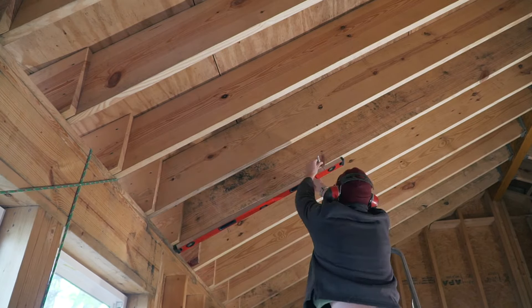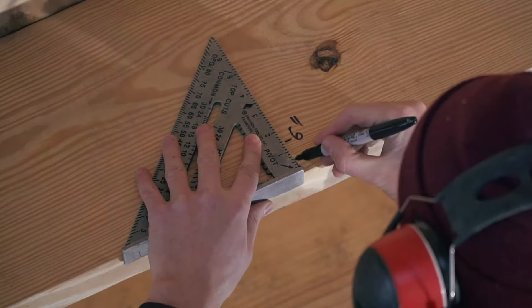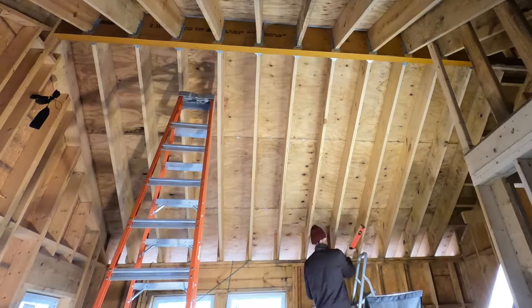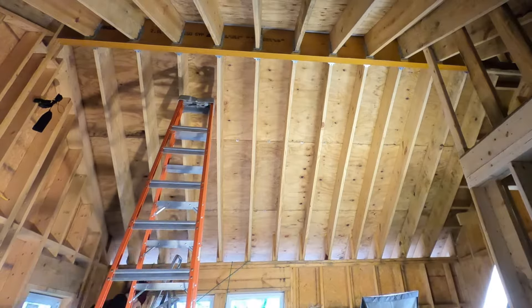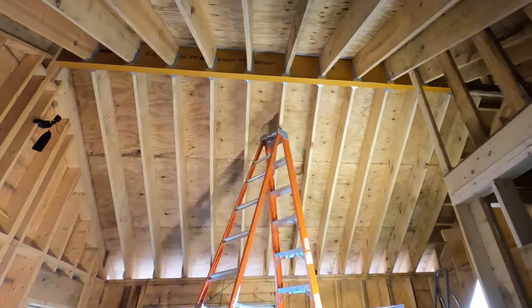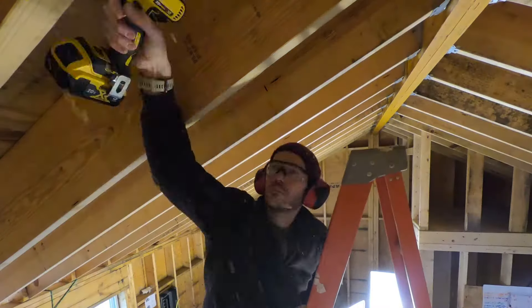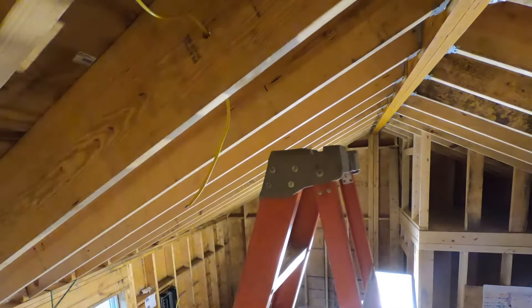Now that I've brought power into the switch box, the first wire will go to all my recessed lights. The first step was to place a mark where I wanted each recessed light to be — I arbitrarily chose 3 feet 6 inches — and then drill all the holes I would need to run the wire to feed into those recessed lights.